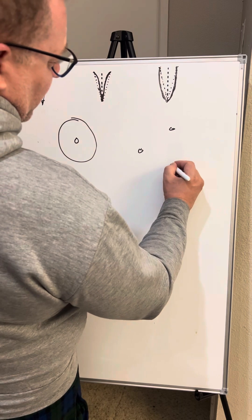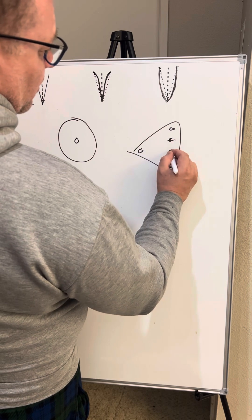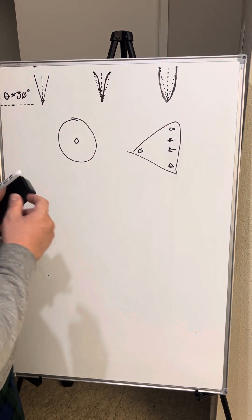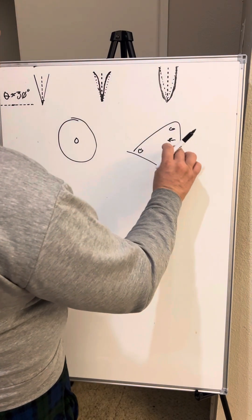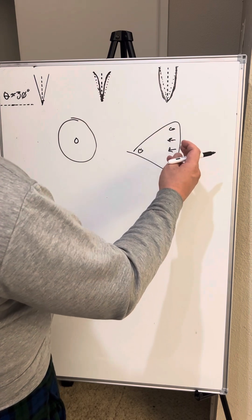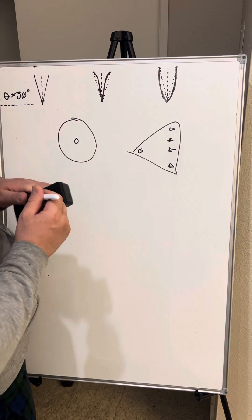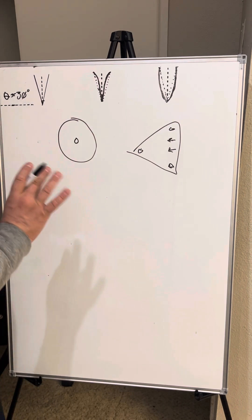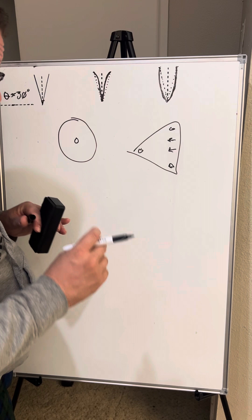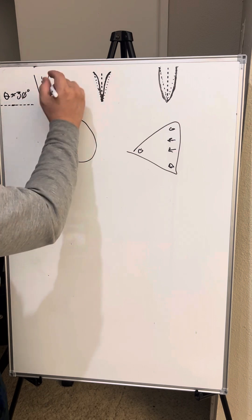The belt has flex, so you can flex it in and it grinds a curve — something more like a hyperbola instead of a parabola. In my opinion you want the parabolic one, but the hyperbolic isn't that much different. Most of the time when you're grinding by hand nowadays you're making a flat secondary bevel, and when you grind it through, it's flat.